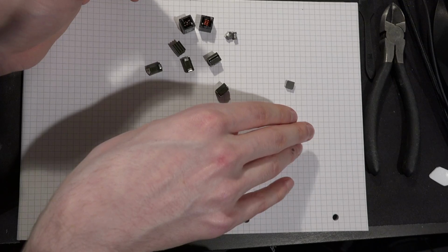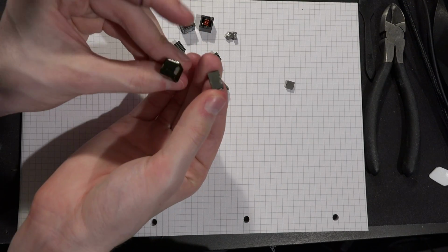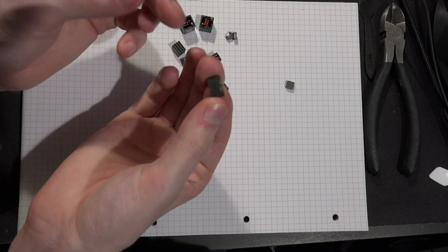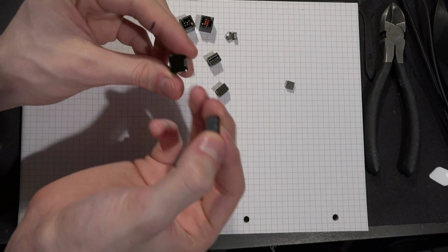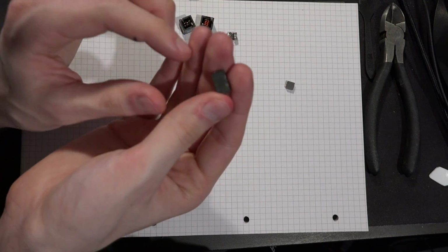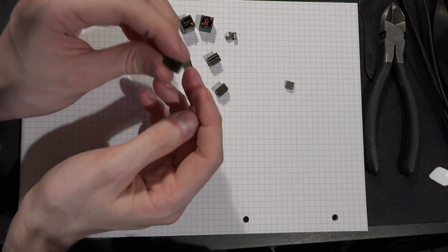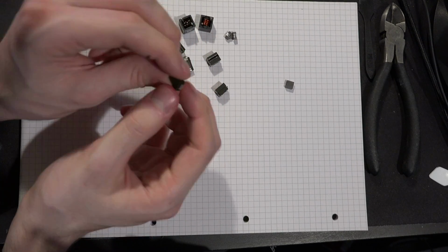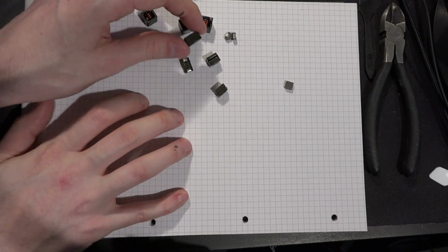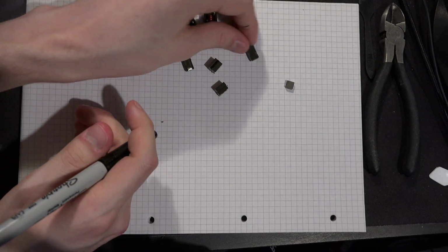And if we compare it to this one, it's relatively low inductance, but again, this is a tiny little inductor off of a GTX 480. This thing's good for 60 or 70 amps. This is only good for 40, 45-ish. So these are really popular on high-end GPUs because they can carry a ton of current, and they're relatively small. The problem is they do whine a lot. And the reason why it's so bad, especially with GPUs, is because GPUs just exaggerate the issue of the coil whine.